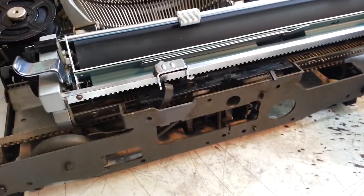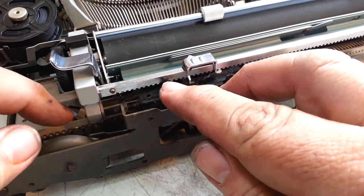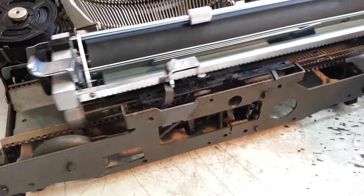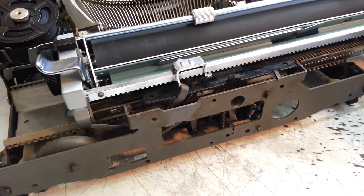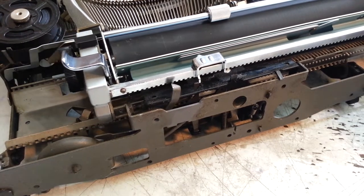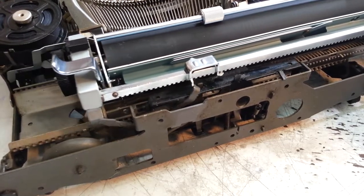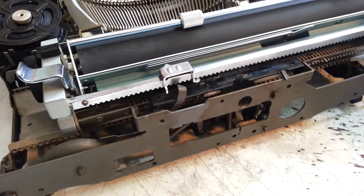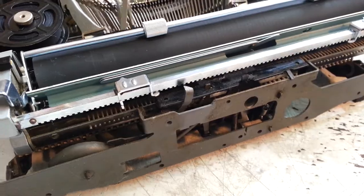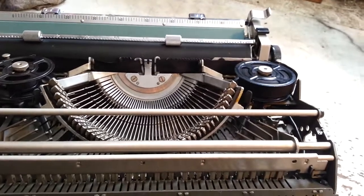First thing was flush and lube. Second thing was adjust the clapper a little closer to the bell, a little closer to the edge. And then the tip here — I made it so it engages just a little bit longer. It still resets. I think we got the Olivetti Bell repaired. Good deal. Phoenix Typewriter. Good day.